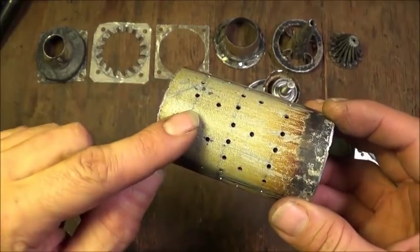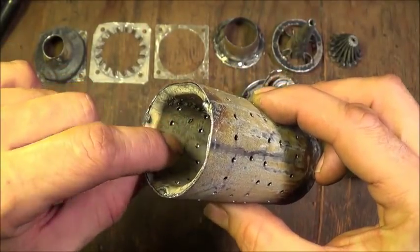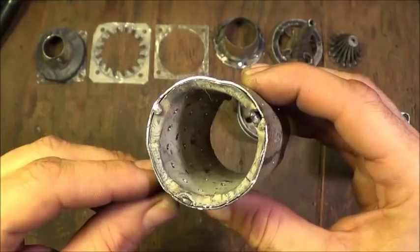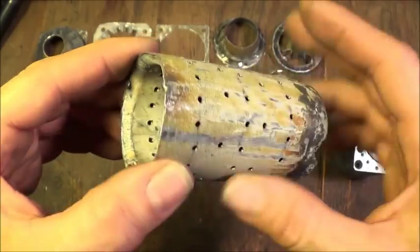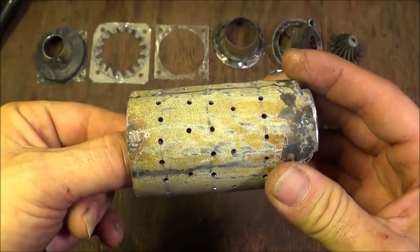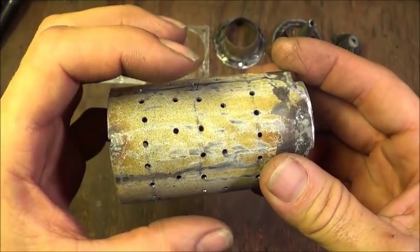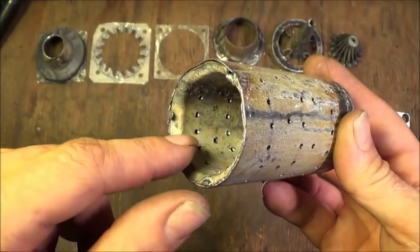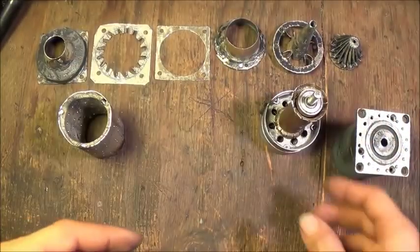You can see the burn chamber for the system — it's a dual-walled chamber. You've got your outer wall with all small holes and your inner wall with an air gap between the two. The inner wall has slightly larger holes and all the holes in that inner wall are angled towards the back of the engine, so all the fire generated is being forced towards the rear. Having smaller holes on the outer wall and larger holes on the inner wall ensures the pressure from the fire burning has less chance of going back the opposite direction, while the compressed air coming in diffuses into a lower pressure, higher volume as it enters the fuel chamber — the gap between the two walls — then exits through the inner holes mixed with the fuel.